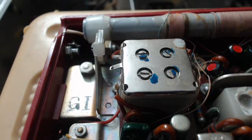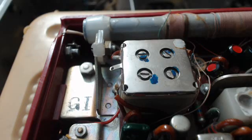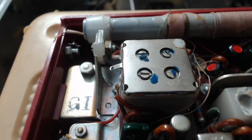But, you know, I being a repairman at heart, born a repairman, when this radio started crackling, I knew it's in the tuning cap. And now I think I have to verify why. See, that's in my mind too, because it could be just a tiny piece of solder that dropped in there, you know. I don't know, but you want to know why it fails.